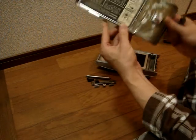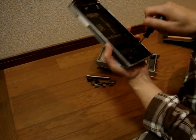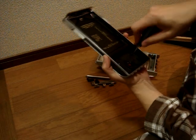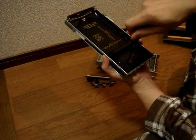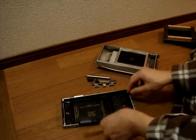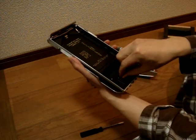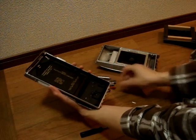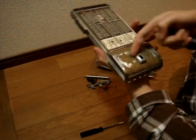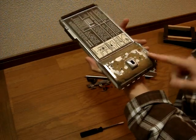Once you've done that, you probably want to remove this lump here, which is quite ugly and useless. There are four slot-head screws holding in the red locking side switch. We remove the four screws, and there's a little retaining plate you don't need, and then the switch with the little pin — all unneeded. So that's all the junk you don't need. Now for this area, I'm just going to cut this out with a Dremel, which will leave a square hole. I'll patch it up with epoxy and a metal plate, smooth it down so it's ready for the leather.